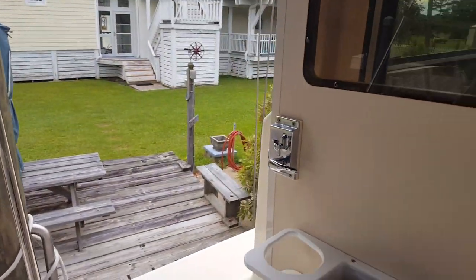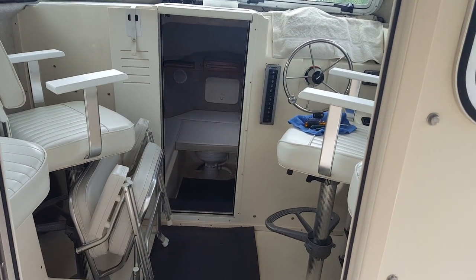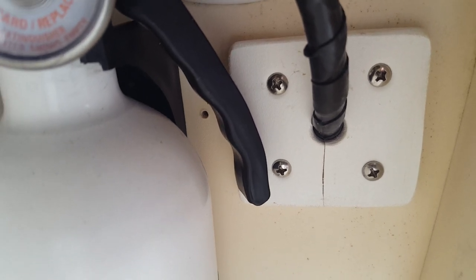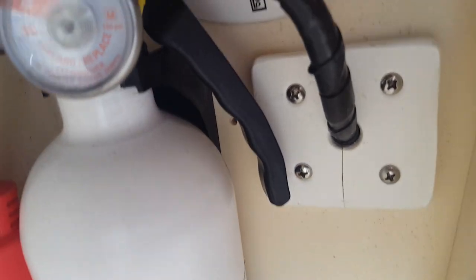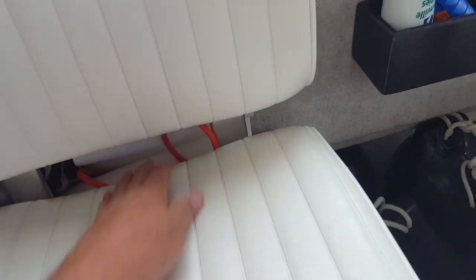Another quick project — easy. When we're in this boat in the wintertime we sometimes use an electric heater, but you had to run the wire through a window or door, always leaving a crack or gap, and the same issue with a fan in the summertime. So I simply got a heavy duty six-foot extension cord, cut a big hole right there, got a piece of starboard plate, cut it square, then cut it in half, and sandwiched it back together because there's a big hole behind that where the plug had to go through. That just runs into the cabin inside — just an extension cord I always use on a ground fault receptacle. It's just temporary until I put a proper receptacle in here, but it's a quick way of getting power into the boat without running an extension cord through the window or door.